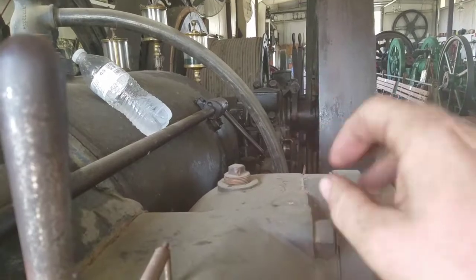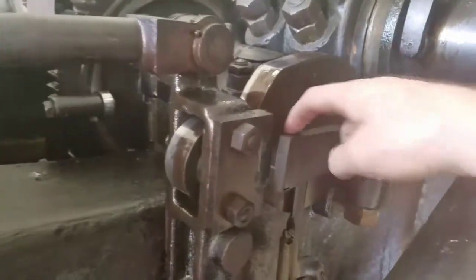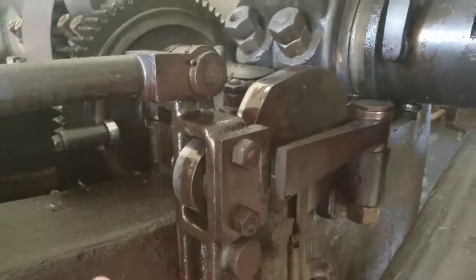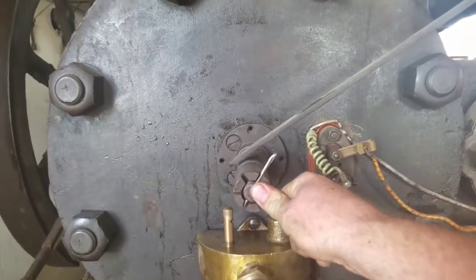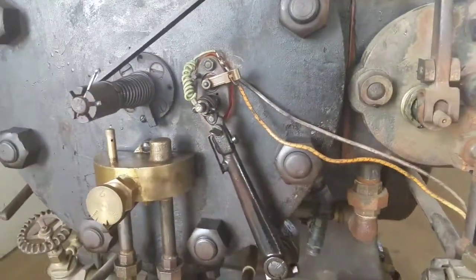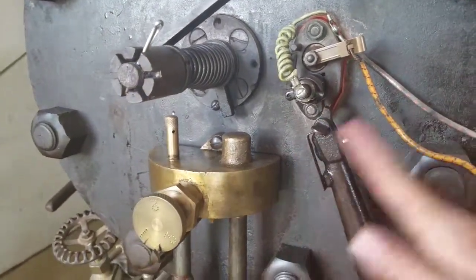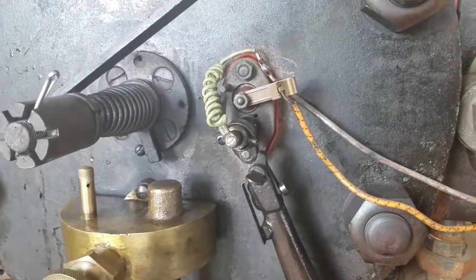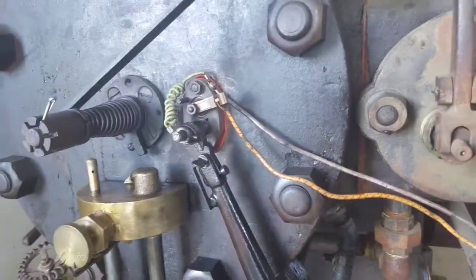So when the weights relax, the collar there goes back, and this comes into this position, allowing the exhaust valve to actually close. When the exhaust valve closes, as the engine moves around on the next intake stroke, it creates a vacuum in the cylinder. Since this is a light spring, it simply opens the intake valve, pulling in a charge of fuel and air. Then every revolution, the igniter — this lever goes back and forth, tripping this cam — which operates points and creates a spark inside from the igniter coil over there on the wall. And so it fires.